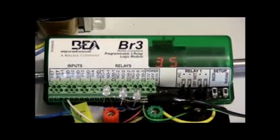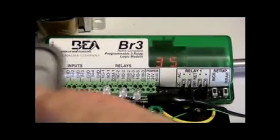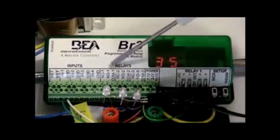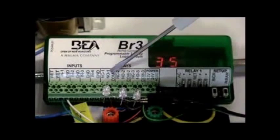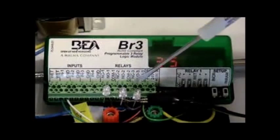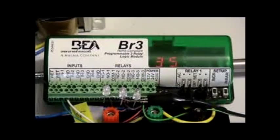But we're still not done. If I take my transmitter and try to activate it — nothing. Maybe you can hear the receiver clicking its relay but it's doing nothing. The receiver is giving an output on the green and the white wire, which you see going to input 1 and ground respectively. The BR3 has relay 1, relay 2, and relay 3, each with an LED which should come on once the relays are active. We still have to tell it to do something.